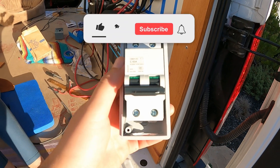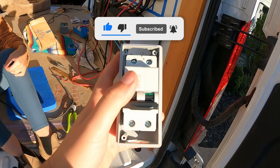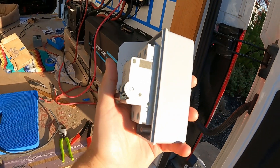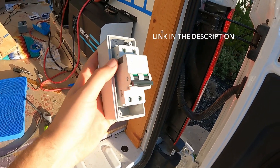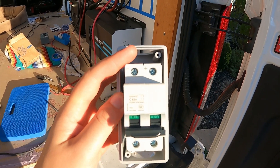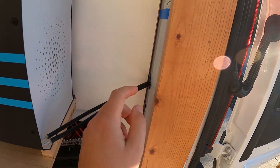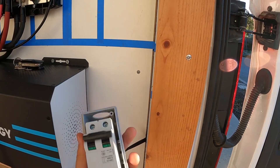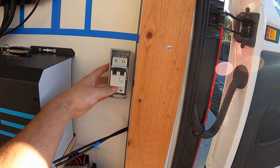This is our solar breaker — it's not really meant to be a breaker in this case, it's just going to be a solar disconnect. This breaker shouldn't actually trip ever; you don't actually have that much power going through it to make it trip, and that's the way we want it. If you're using this same one, there's a positive and negative sign on the top which is the input side, and the bottom is the output. Since our solar wires are coming out of this side and going up to our MPPT, it makes more sense to have the input on the bottom, so we're just going to mount it upside down.